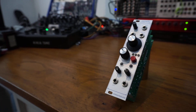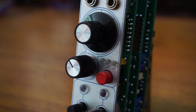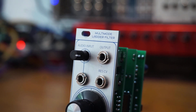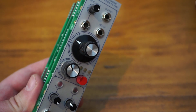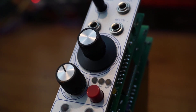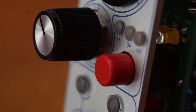Hi, I'm Kinkas, welcome to the channel! Today we're building the DaniSound multi-mode ladder filter kit from THONK. This 4-pole filter is based on the Moog transistor ladder, but adds bandpass and highpass modes, a resonant CV input, and bass compensation when using high resonance in lowpass mode. The input can be soft clipped and features an attenuator to control the amount of saturation. The modes are accessible via a push button that toggles between them, and the selected mode is indicated by one of three amber LEDs with light pipes.